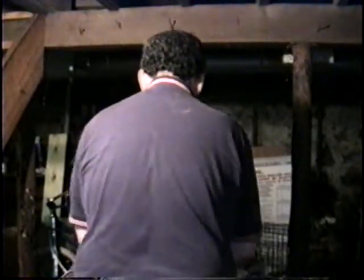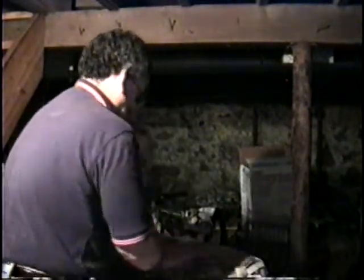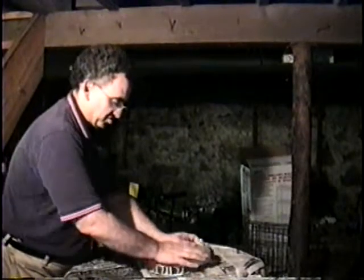This is mind-numbing work to a large degree. But if you want to do an optical flat, if you want to make a telescope, this is what it takes — a long time, a lot of just glass over glass, just pushing away.